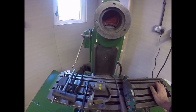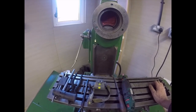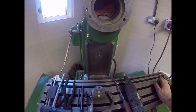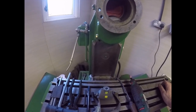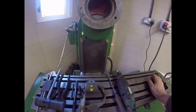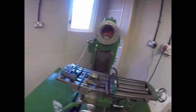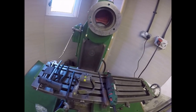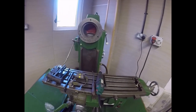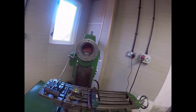I actually measured the hole at 10.66mm and the pin was 11mm dead, absolutely bang on. So there's no way that hole was 11mm. It looks to me like although the machine is metric, they were still using an imperial pin. I sized it with a drill bit — tried a drill bit in that hole and there was no way it was going in — so I don't know what the specification was. Anyway, I'm going to take it off now and knock a gasket out.